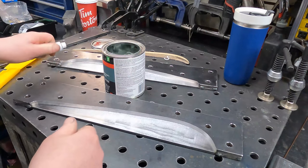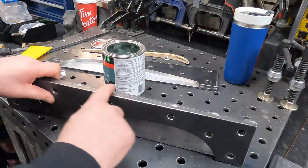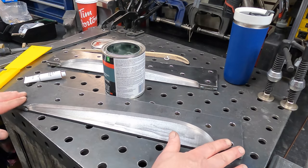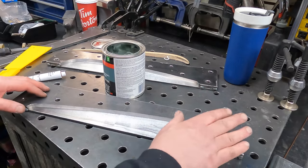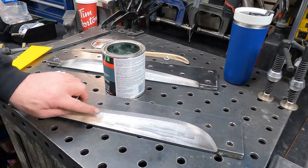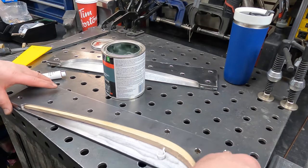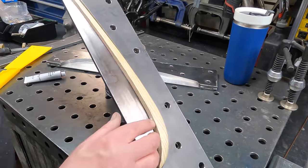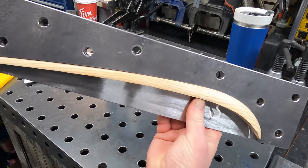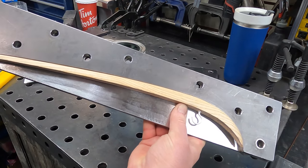Next up, welder up — just tack it in place and we're ready to go. With the parts tacked in, I just gave them little fingers of weld — that's all it needs. Remember to chamfer the right holes. I need that edge on the top of the die to be sharp. Then I double-checked my fitment. The die basically has to fit as perfectly as it can to the wood because we want the top edge of that die to do the work.